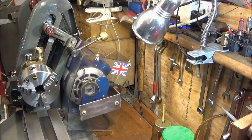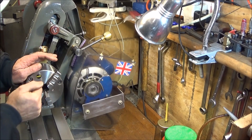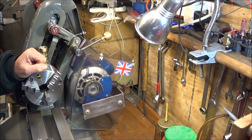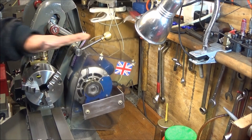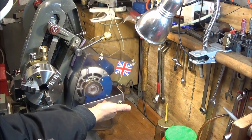Having a good quality guard like this should prevent all swarf from actually getting into it. All you need to make this enclosure is three pieces of polycarbonate — it's called Lexan polycarbonate. I bought A4 size and it's three millimetre thick. It's very strong, flexible, you can drill it easily without cracking, and you can bend it with heat. It is actually recommended for making guards for machines.